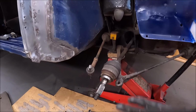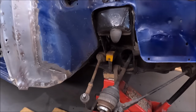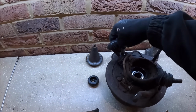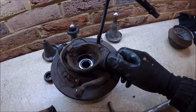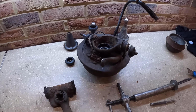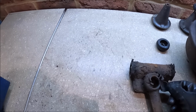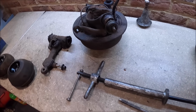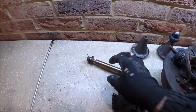So as you can see, I've whipped out all the front drive assembly and the front suspension donut, and that is because I'm going to be replacing these swivels, top and bottom. I'll do them both. What's the point in messing around? But this was the one that I showed on the video that was just loose, so that's not great. The brakes themselves are fine, although we'll give them a clean up. Top arms, there was no play on the top arm, but look at the state of these rubber bushes. So they need replacing. The pin looks okay, which is good.